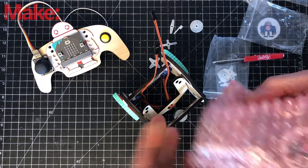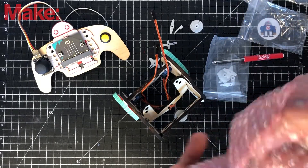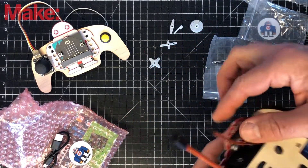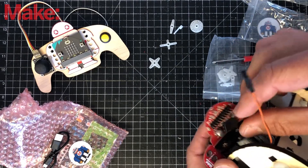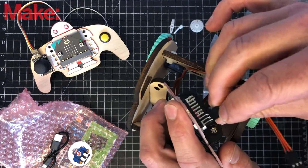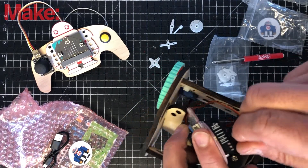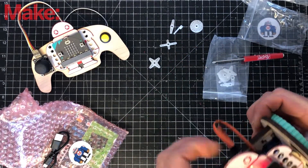Open up the case — the Makey bit with the little driver sticker is the pre-programmed one we need. Also in the case or bag is a USB cable for downloading new programs if you want. The black-marked motor is one side, and the tape-marked one is the left side. Connect the bottom three pins with the metal pieces going up — orange, red, brown — then right above it, connect the other servo the same way: orange, red, brown. Now it's ready to be driven.